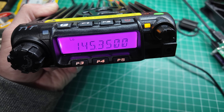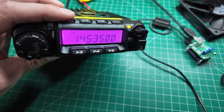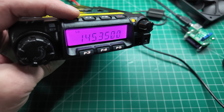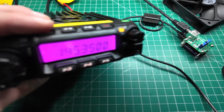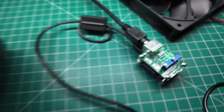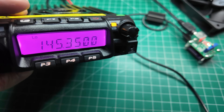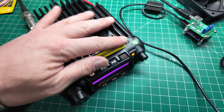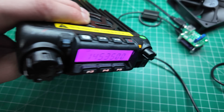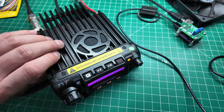One thing to keep in mind with this radio: if you start pressing buttons to program things on the front panel while it's connected to the TOADS DI board, it does some funny things. For some reason it sends signalling back and causes it to transmit — pressing the function button seems to trigger transmit or receive something. I recommend not pressing any buttons or reprogramming the radio while this is plugged in. Just unplug it, make your changes — power levels, tones, frequency — then plug it back in, otherwise you may get erratic operation.